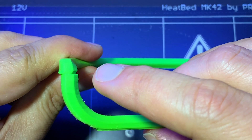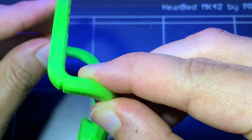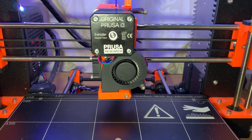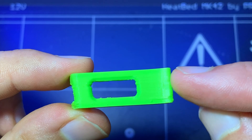In today's video I'm going to explain what shifting along the X axis of your 3D printer is and how to fix it. X axis shifting is when the print head becomes out of sync with the 3D printer software, and this results in prints along the X axis being in the wrong location — meaning your vertical walls end up being slanted or wobbly.